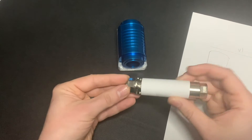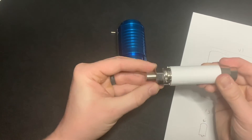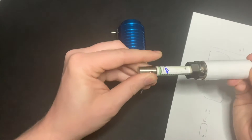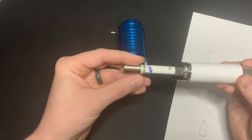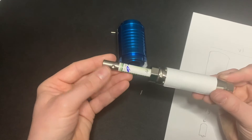Here is the one that was holding in the draw bar. You'll see it has a chamfered end, and the other end may also be round or flat — this one varies. With both pins removed, you can now remove the draw bar. Once you pull it out, it will typically have your certificate right there. Some people leave them in, some people take them out — to each their own.